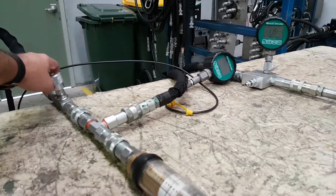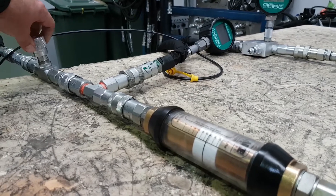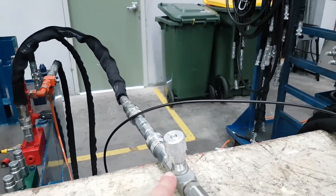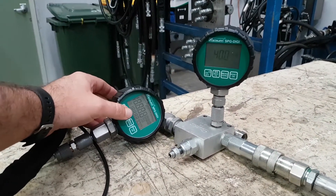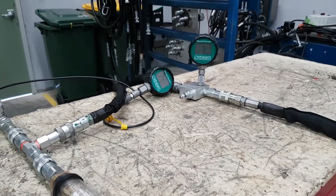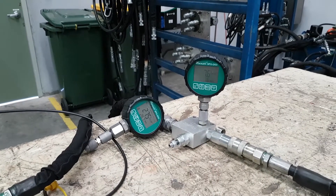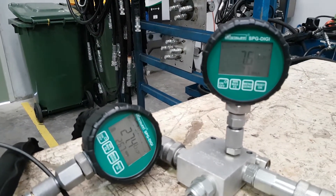Using our flow control we'll set our flow so that we've got eight litres a minute. The flow control is set at eight litres a minute, and our pressure gauges will show us that we have around about 20 bar pressure difference across the two. That 20 bar is maintained — the pump is going to maintain that 20 bar across the flow control, and that's what maintains the flow no matter what the pressure is on our load. So we've got 27 and 7 on our two gauges.